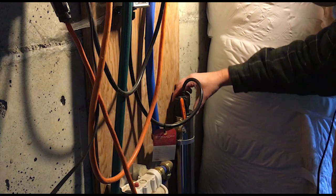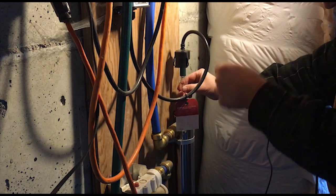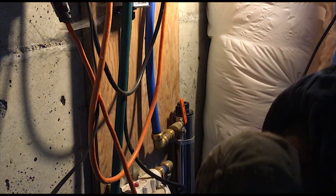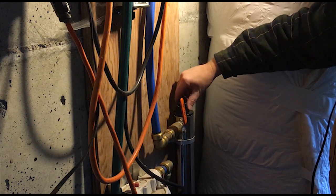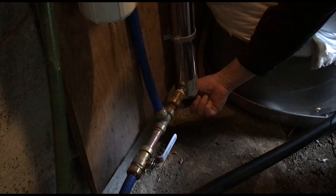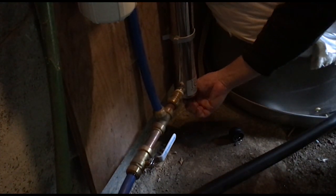We're going to remove the top here — it's got two little pieces that you just push in, and then that pulls up. The lamp is stuck to it, so you want to hold on to that lamp so it doesn't fall. Now we've unplugged it, so we remove the lamp. Then unscrew the little top cap. Now unscrew the bottom piece, and you've got to be really careful that you don't let that glass sleeve slide out of there. Just as you unscrew it, keep some pressure on it, keep it lifted, and slowly let it out. And then you'll see the glass here.